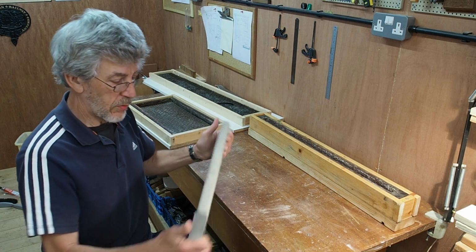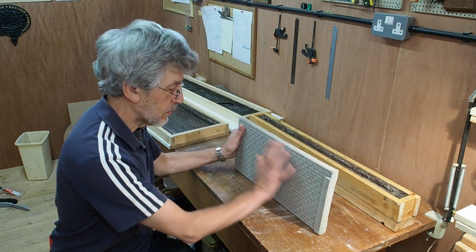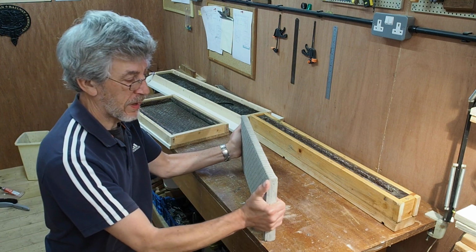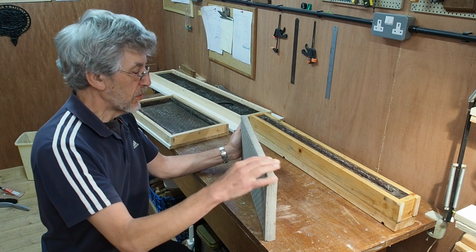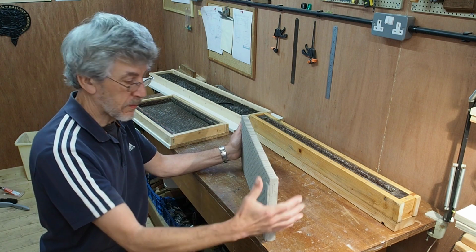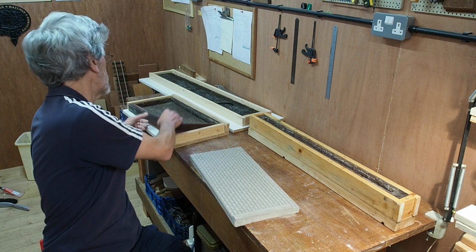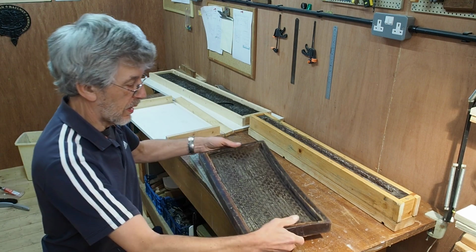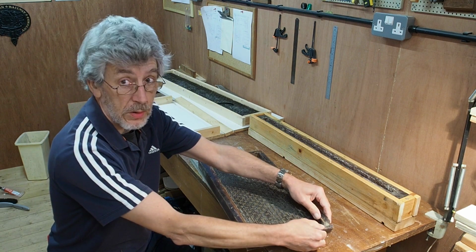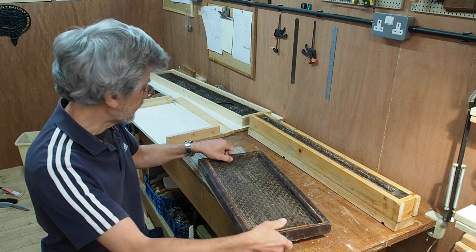Now for the vertical wall section, slightly different set of problems here. The likely delicacy of the slab of concrete was going to be determined by how thick it was. I wanted it to be a reasonable block thickness so that this top edge looked like a sensible depth. And so the whole shape of this is very different. So here, of course, given the outer frame, I could now be much more flexible along the edges. Even so, I've still cut the corners just to make it easier to get the concrete out of the cast at the end of the day.